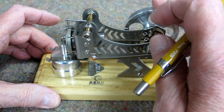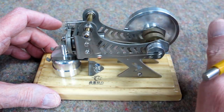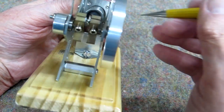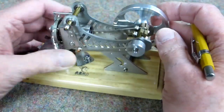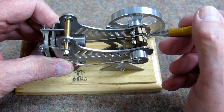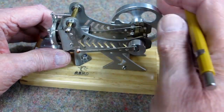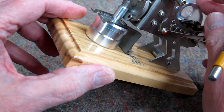It has a snappy feel to it — snappy because it pops cleanly — which gives the appearance that it's ready to run. Maintenance-wise, there's not much to do. I would put a little oil right here on this pin for the connecting rod. This piston appears to be made out of carbon or some black material; we're not going to mess with that. There are a couple of little nylon washers that keep this from getting up against the offsets for the crankshaft. This one does not want oil in the cylinder. I would use molybdenum disulfide if I need anything — we'll wait and see before adding anything.